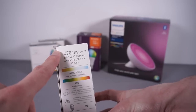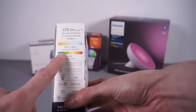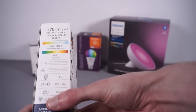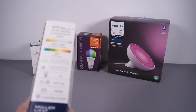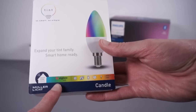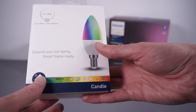These are 470 lumens, apparently, although that will vary based on colour temperature and the colour you've picked. They're configurable colour temperature between 1800 Kelvin and 6500 Kelvin, which is a huge range, and they're full RGB as well as RGBW — so you can have proper accurate whites out of them with configurable colour temperature. And as you can see on the box, they're Zigbee.